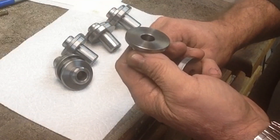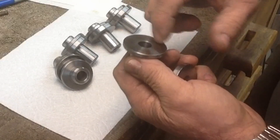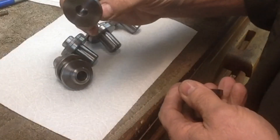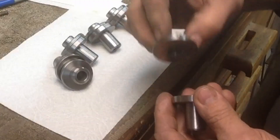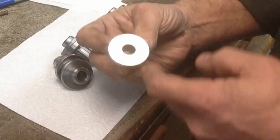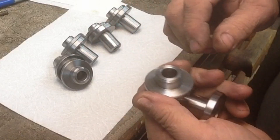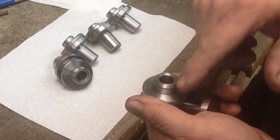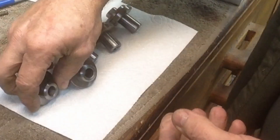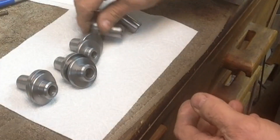And while we've still got it in that situation and perpendicular to where our holes were, we can go ahead and face off the sides and dimensions on those. So rather than putting them in an index table and setting them up in the mill vice to machine them off that way, I think we can just as easily do it on this side by cutting them off there, then flip them and machine away the clearance sides on the slots for our cap screws. That's the program we're doing — let's go over to the mill and get it set up.